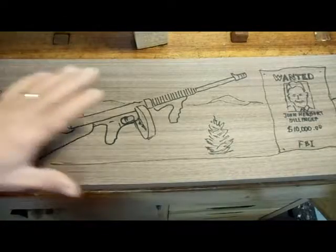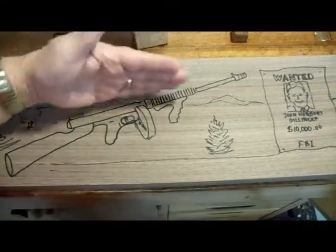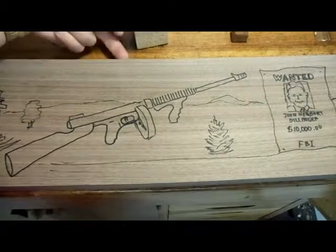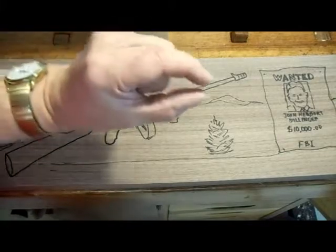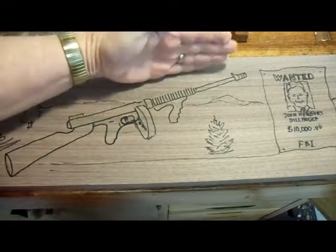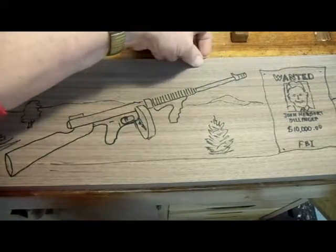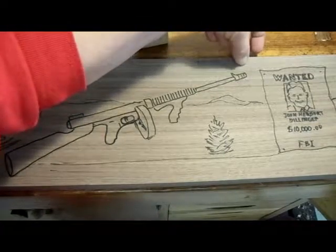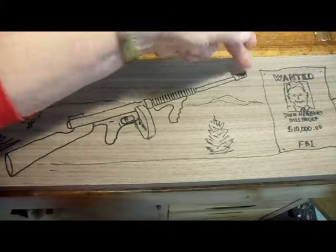The drawing is put onto the walnut. I had to shift the drawing down a little bit because there's a lip under here — a rabbet — so it's quite thin right in about this far. I had to pull the drawing down because I can't carve up that high; that will weaken that area. So my carving will be starting right about here and working down.